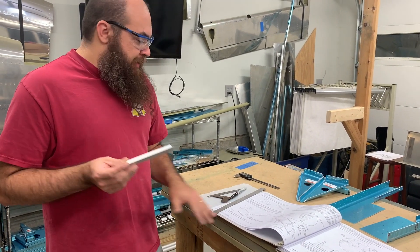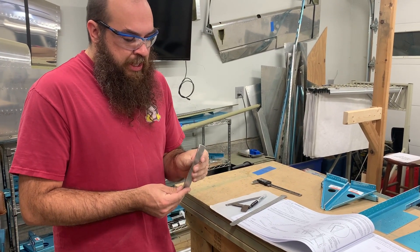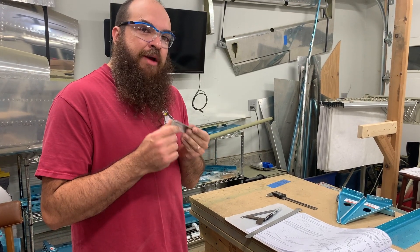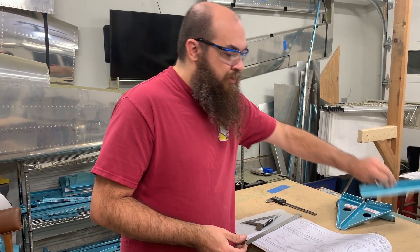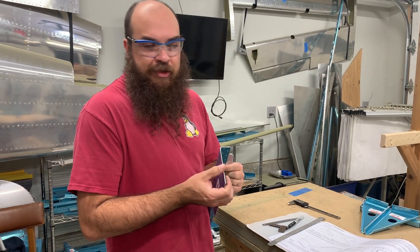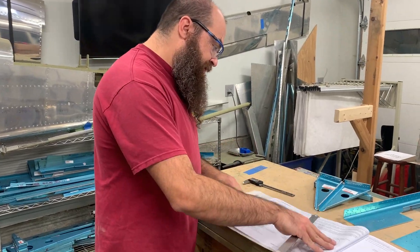Here's the first one - it says to create two of these, of course I'm not going to make a video of doing exactly the same thing twice. It's nicely deburred with no issues. My rule of thumb for deburring parts is: I want to be able to run my fingers on it with no doubt that I'm not going to cut myself. If I feel things I could catch on or cut myself on with enough pressure, then it's not deburred enough - that's just my rule of thumb.